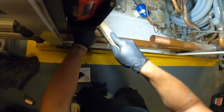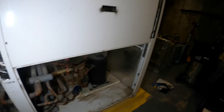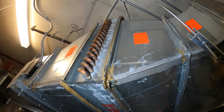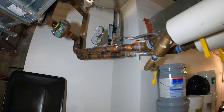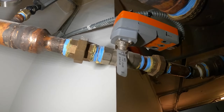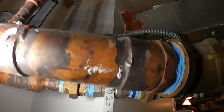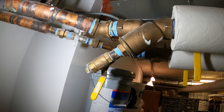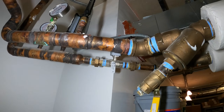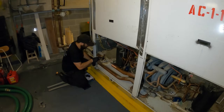While this gets cleaned up, let me show you guys: there's a two-circuit system, the two fans are up here. We actually have emergency heat — there's a hot water coil here. We've got a Belimo over here, but this is not a two-inch pipe — you can see how they expanded it — this is an inch and a quarter pipe. This thing is controlled by BMS. We've got a big strainer here. The valves are closed — we don't want the heat coming on. But for some reason the BMS was energizing the heat instead of cooling, and this valve wasn't opening.